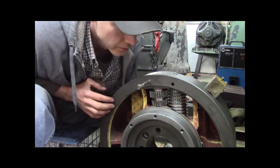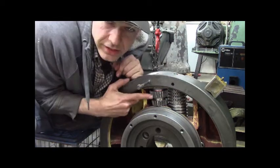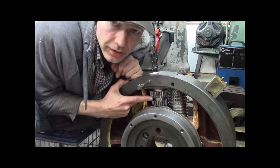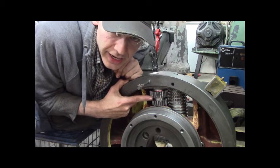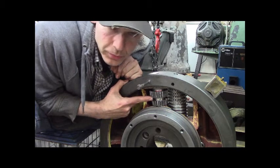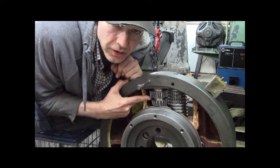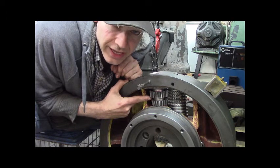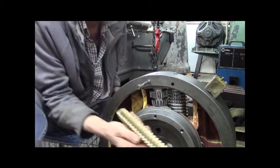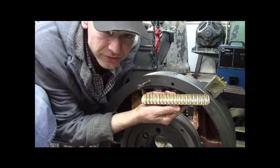I'm going to concentrate on these gears here. I've got this thing taken apart and what I'm trying to do is allow the adjustment of this head, just like a regular boring head like you'd have on a Bridgeport. So this is the back of the head, and these gears allow the slide adjustment - the offset.